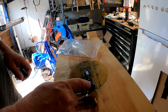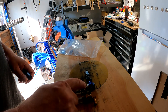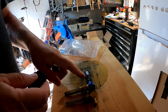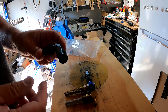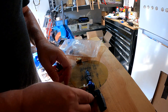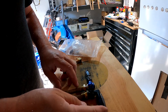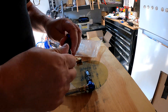For comparison, this is the stock one - you can see how much bigger this banjo fitting was. I have scoured the internet to find any banjo fitting which is more compact, because I know there's a million of them that go from 1/4-inch NPT into the AN6, or even something I could convert to AN6. Believe it or not, this one I got on eBay - thanks to somebody on the forum - is the only one I could find. As I alluded to previously in episode 16, these are too big to fit in there without carving some wood. I found these as part of my JEGS order, and based on the description and picture I thought this was going to be smaller. It's not. You can see the problem - now the banjo fitting I have looks pretty compact compared to this. This is almost big enough that I would have to run the fuel line on the outside of the wing, rib number one, and I don't plan on doing that. So these not-inexpensive fittings turn out to be not the ideal solution.